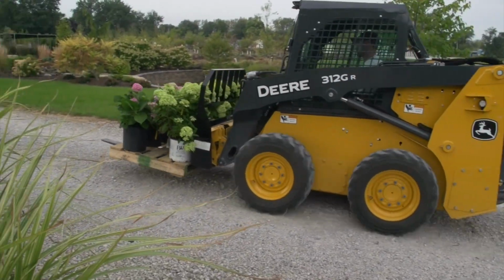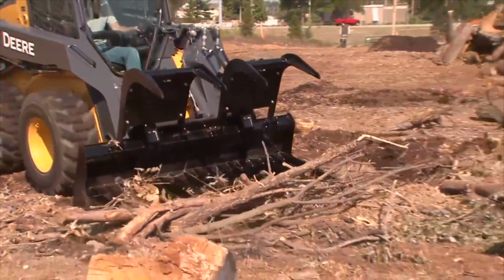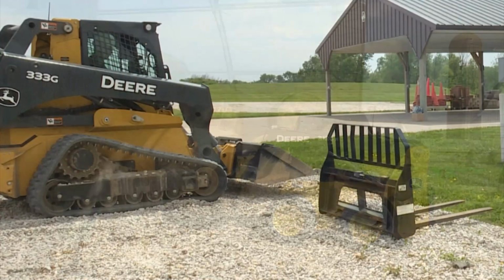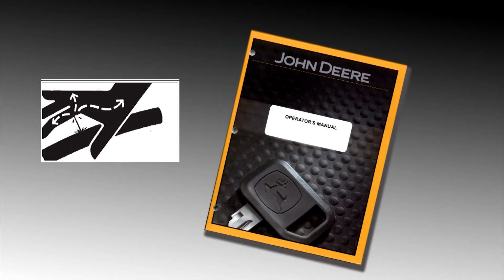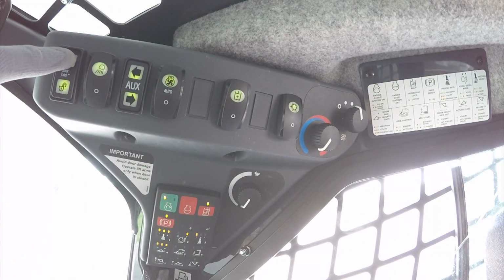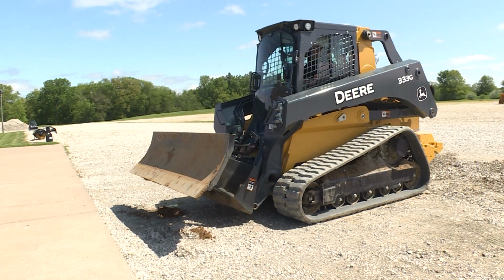John Deere provides numerous Worksite Pro attachments in a variety of sizes for use with different materials and applications. Be sure to use the correct size attachment for your machine and job. Prior to disconnecting a hydraulic attachment, stop the engine and release the pressure in the hydraulic lines. Caution: hydraulic couplers will be hot after operation. Warning: to prevent injury, lower the lift arms fully before engaging or disengaging attachments. Always make sure your attachment is properly secured to the mounting system, whether it's equipped with manual or remote locking.